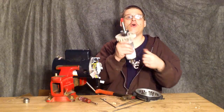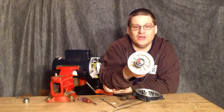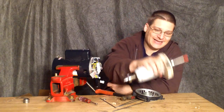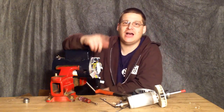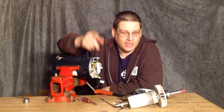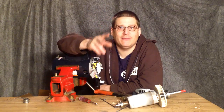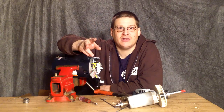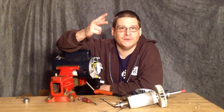Now you'll see there's a 6204 bearing in the front. So once again: 6204 bearing in the front, 6203 bearing in the back. Go to wetheadpumprepair.com and search the drop-down for UST 1202. Remember: 6204 in the front, 6203 in the back. This is Joe Tamargo. Peace.